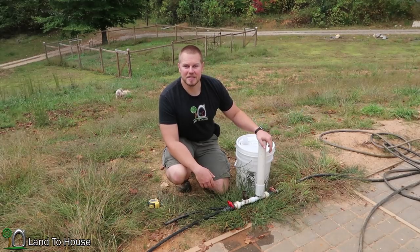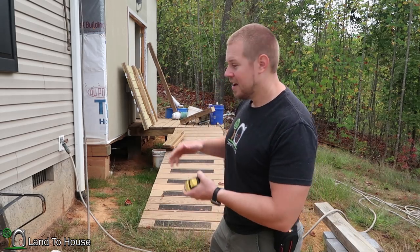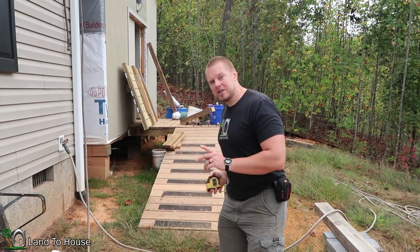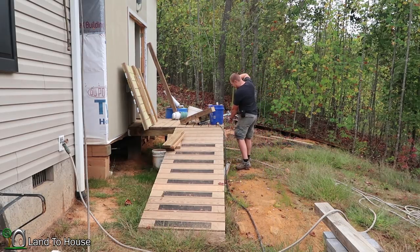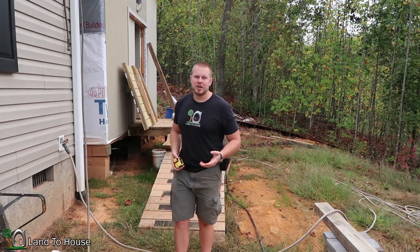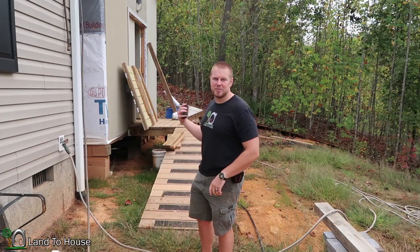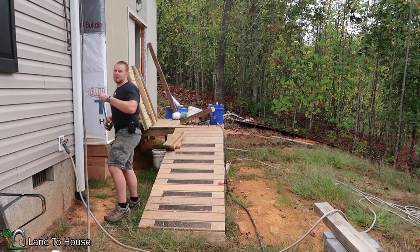First let's test out this model here. There are a couple of values I want to get — the head pressure and the delivery height. The head pressure is from this blue bucket here. I'm going to guess total about three feet. I'm not going to count the hydrostatic pressure since it'll be adjusting as the water goes down — we'll just consider it to be out of the equation. It'll be the same for both.